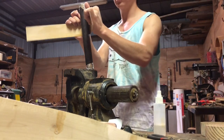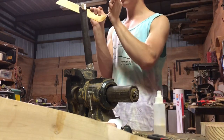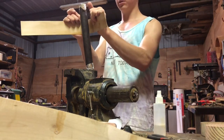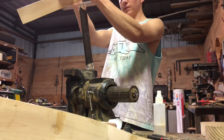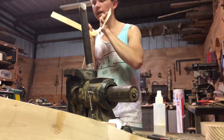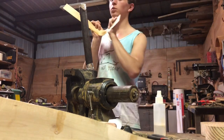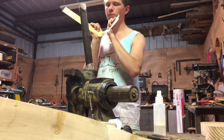You can cut the long part off of the end. I tried to cut both of these so there will be plenty to cut off at the ends, so I have a little bit of wiggle room to play with, but still you want it to be pretty even on both sides, just to be safe. And I did not sand or polish the sides that are going to be the exterior yet, because when you spray the water on them, the grain will pop back out, and it'll make the can look a little ugly. No, not super purdy.